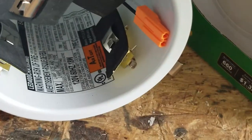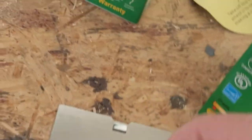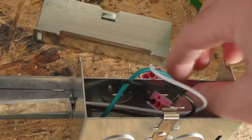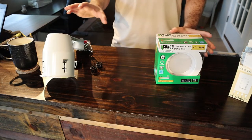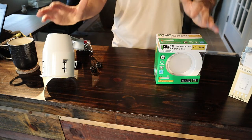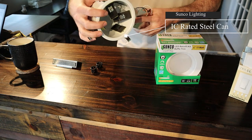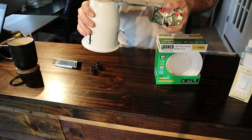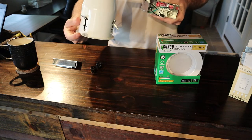There's a quick plug adapter and a lot of quick connects here — this is really cool. So here are all the pieces you will need; I have all of this in the description with product links. First and foremost you'll need the light cans. These are four-inch cans that are IC-rated, which means you can stick these straight to the insulation without any fire danger. They're made out of really heavy duty metal.